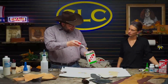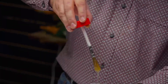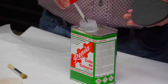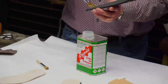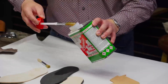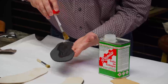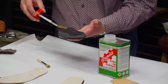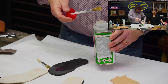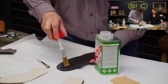One thing you will notice in direct comparison to the Topfit — this looks a little clearer, but it will draw strings a little easier than the Topfit. The Topfit pretty much cuts off right away. Take the brush off and done. This, especially if you have a can that's a little bit older, tends to draw strings a bit more. And that is not a quality issue — that is caused by what we do to make that neoprene resistant against the plasticizer. We change it chemically, we make the molecules longer. And that is what causes it to draw strings more easily. It is actually working as designed.